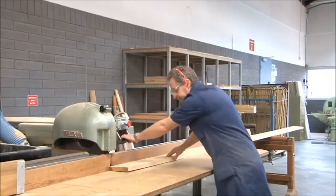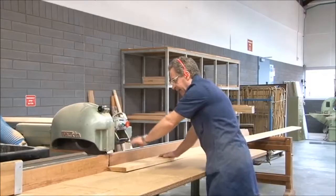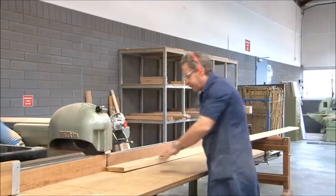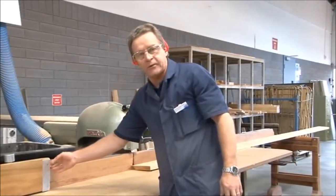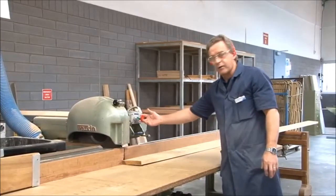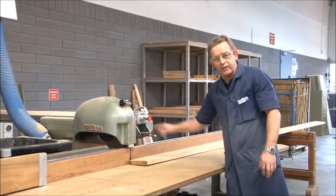The best way to do it is with your left hand on the handle and your right hand on the workpiece — not crossing your hands. We've also set the stop to a pre-set size, so that's all ready to go. Now that we're ready, we pull out the red button and then press the green button to start the machine.